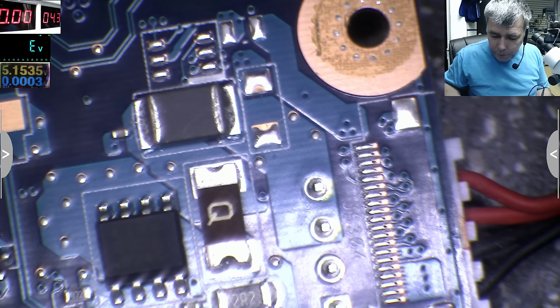So you see, in this case, we didn't use a power supply. But if you have a shorted capacitor on any power supply, it will be a little bit tougher, more harder to find the problem. If you have time to spend, you have schematics, here you can find exactly why this MOSFET is not open. What I did, I just bridged the MOSFET because it's easy.